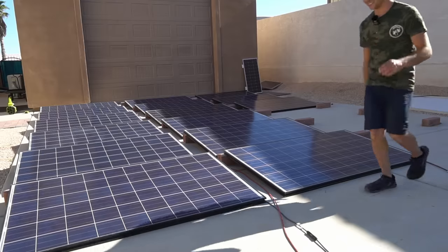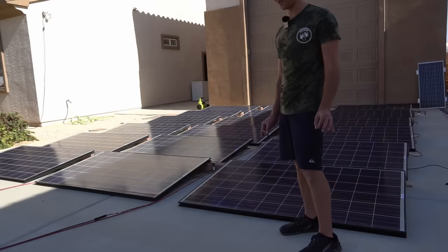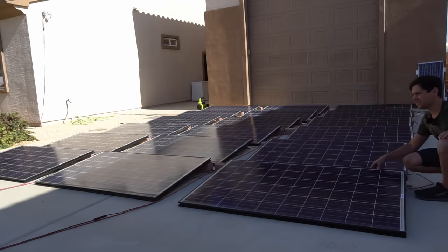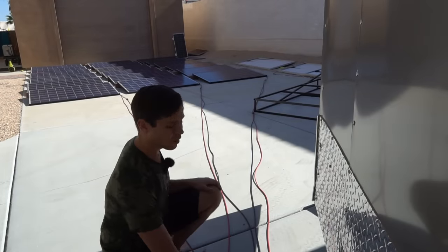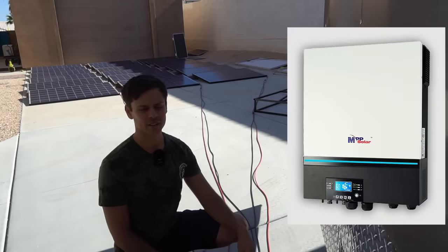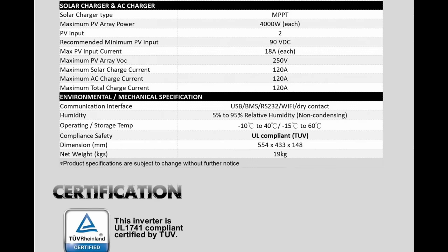Almost done — I'm tired, this is a lot of panels. A 4,500-watt array built in less than one hour. The bricks angle the panels at seven degrees, and at my latitude that's plenty for summertime — I should get five to six sunlight hours. For this array we have three strings: two are in parallel, and the third goes to the second input on the LV 6548.